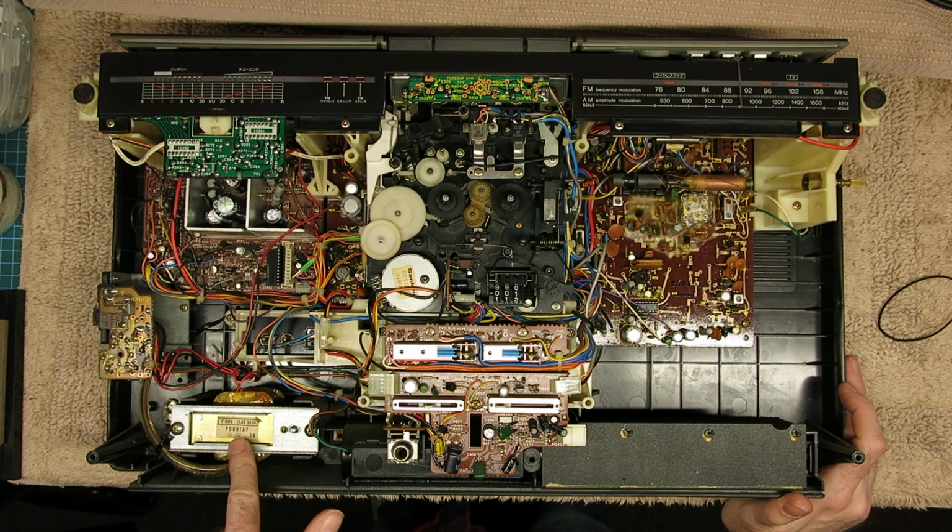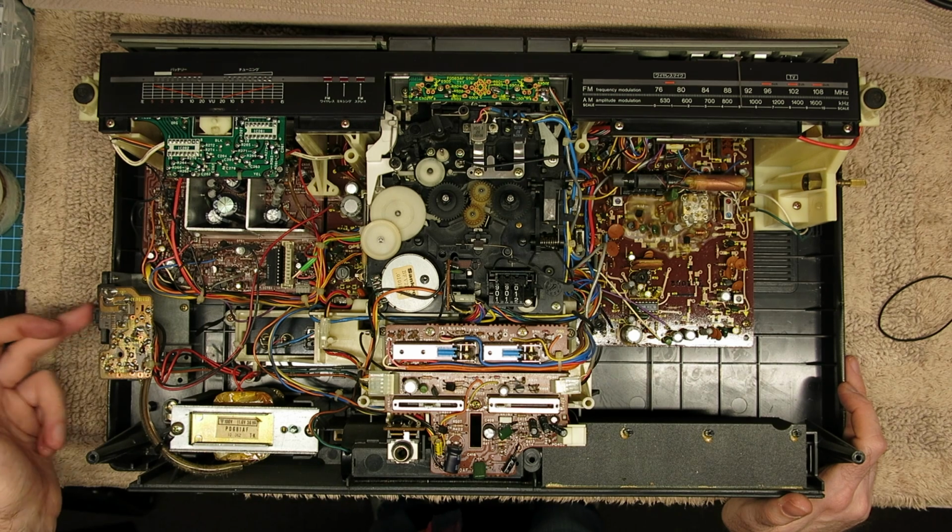there's a transformer which mentions it's a fixed 100 volts, so 11.6 volts, so if you could find a 12 volt transformer to fit that, potentially it could be swapped. I might consider that, but I think mainly we'll think about running it, as I mentioned earlier, off the DC input.